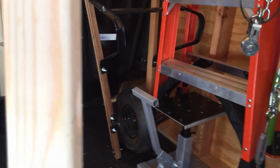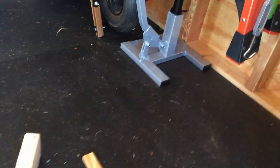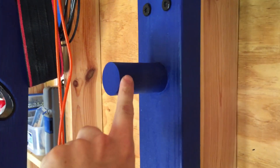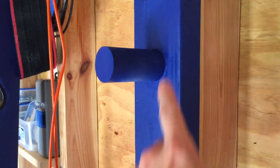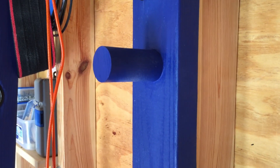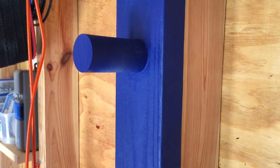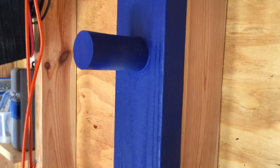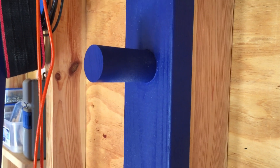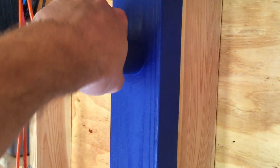This is actually at a slight increased angle. Once you get the dowels cut to length, you're going to want to cut them an inch and a half longer than you want them sticking out, because that's how thick the board is. Then you take the part that goes in the board and give it a little sanding to help it fit. You want it fairly snug but with enough room to put some glue in there — wood glue sets pretty quick and those aren't going anywhere.